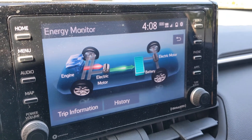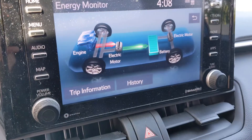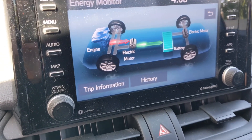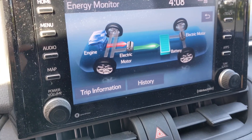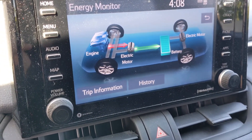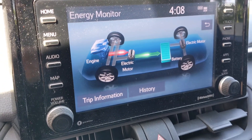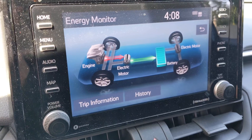This is going to support the EcoFlow pretty much indefinitely until you get low on gas. James also did some testing showing that charging the battery up to about 80% — about 12 kilowatt-hours — takes 1.8 gallons of gas. The car has a 12-gallon tank, so you could do this six times, which is basically six times 12, so 72 kilowatt-hours on one tank of gas.